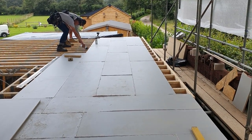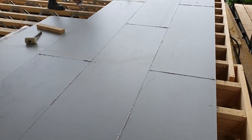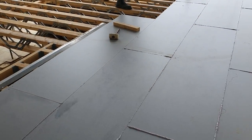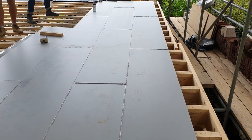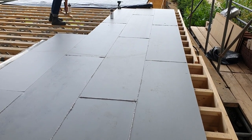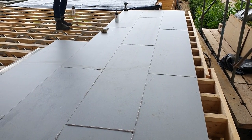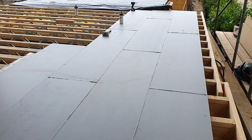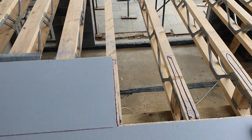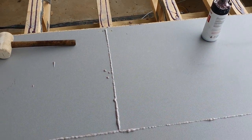It's just a matter of carrying on and working through. I like to make sure that all the joints land on a joist where possible. On this whole run I managed to get it to work, which is really nice. If you're at 400-centre joists using 22mm boards, you can have the boards join with the glue in between the joists. If you're using 18mm at 400 centres or 22mm at 600 centres, it's worth putting a small H-frame of noggins underneath, because on sites governed by NHBC that is basically what you have to do. In this instance, because we've got the board joints landing on the joists, we've got the luxury of not having to do that.